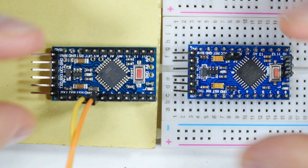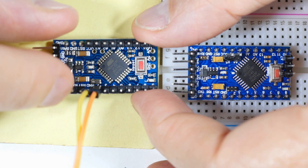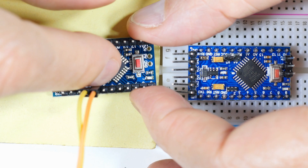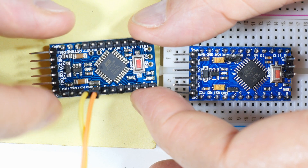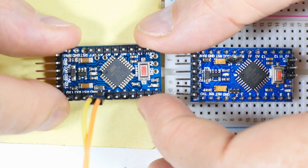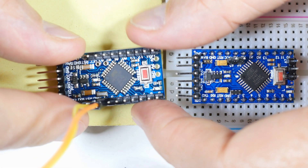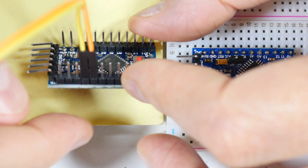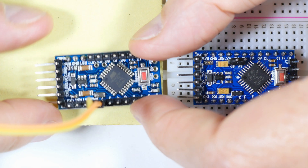The answer is pretty simple. If I'm going to use these connectors like this, it is easiest for me to have the pins sticking upward. That allows me to see the connector numbers — so you can see down here it's like ground, reset, one, two, three, four, whatever along there. So I can see what's going on. And if it was upside down like this and I had to put the jumpers on there, the pin markings will be on this side but the pins will be on this side, so it'll make it harder for me to align where I'm poking the connectors on there.